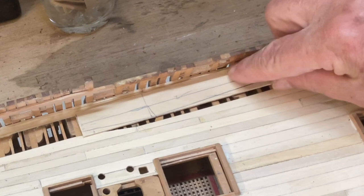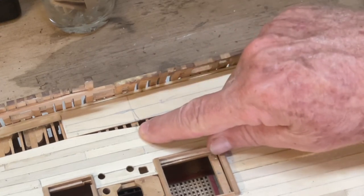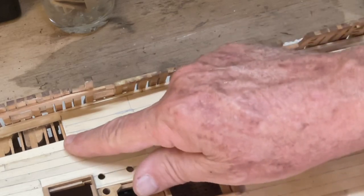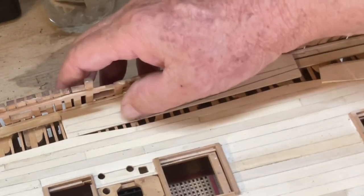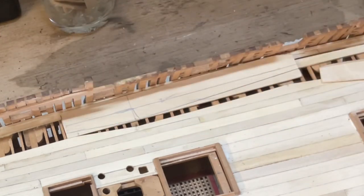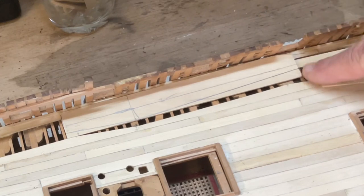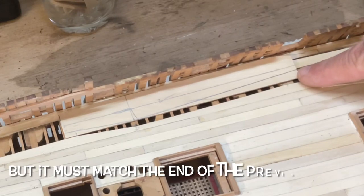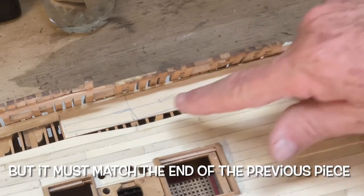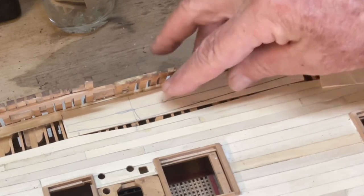So when we go to make this piece up, what we're doing is trying to establish this as zero. And so we take off 8 inches here, and that establishes this line. And then we use the gauge to determine the angle here. This one at this side should be approximately 8 inches as well. So if you wanted, you could just take 8 inches off that line and draw it back to here as a starting point to do the fit.